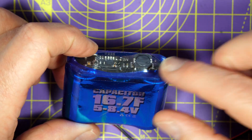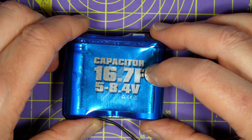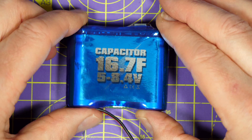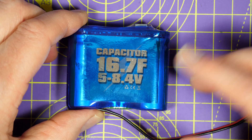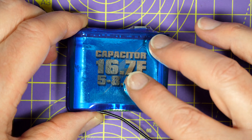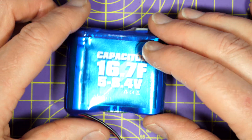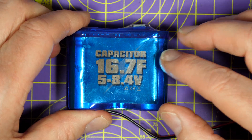These have been around for a long time in the electronics world. They're used when you want to soak up energy quickly but you don't need long-term storage. Although they're used to power backup memory, more recently they've been used to harvest regenerative braking energy on electric cars. A capacitor stores energy by storing a static charge, as opposed to an electrochemical reaction in a regular battery like your LiPo. Putting a voltage across the positive and negative plates simply charges up the capacitor — similar to the build-up of electrical charge when you're walking on a carpet and touching an object releases the energy through your finger. These supercaps have an effectively huge capacitance.